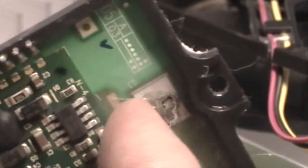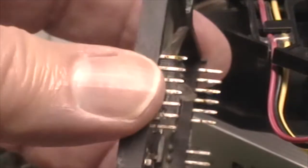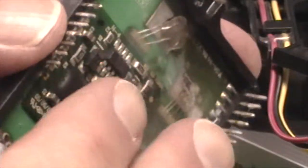If you look at this particular module, there are a lot of differences between these modules, but this one here, the semiconductors, I think they're power transistors or FETs, MOSFETs actually, blew off the insulation. There's 4 of them in here, and every one of them had the insulation blown off when it failed. So I did 2 things. I got a new one that's thicker than this one, and the bottom's covered with epoxy on the new one.